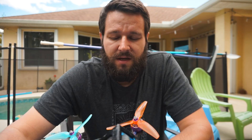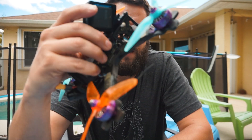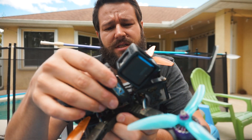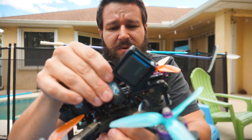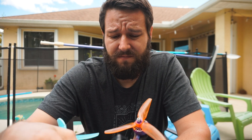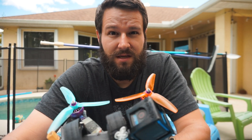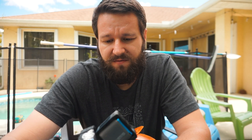For electronics, my flight controller is the Holybro Kakute F7 all-in-one, so it's got the PDB, OSD, and all that built in — keeps me from worrying about a power distribution board. There's not much to say: it's got a soft-mounted gyro, and I soft-mount the entire board as well, which gives you a little extra noise buffer. It flies great.